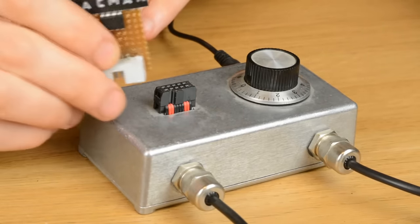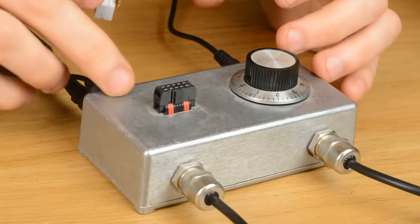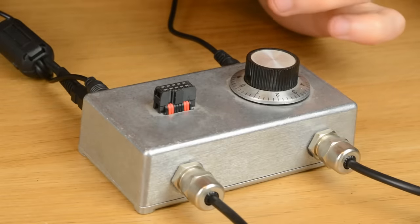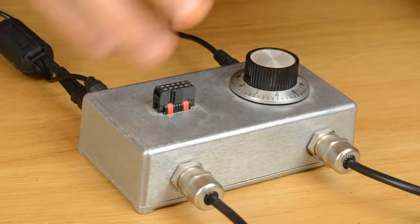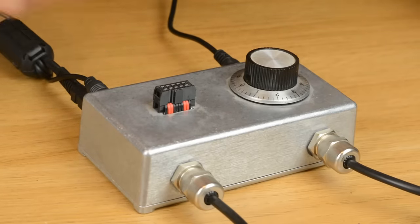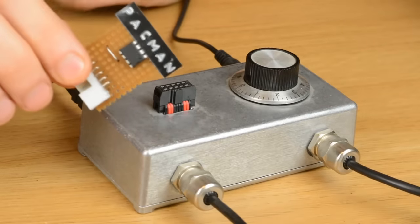But before we load this up, let's talk about what's actually happening when we load a game. The processor is 8-bit, it's an Atmega chip, and the AVR architecture is interesting. It's what we call a Harvard architecture. The program data, that's the flash memory on board the chip, has a separate address space to everything else. So the RAM, the working memory, and the peripherals all exist in a separate place to the program. And similarly, the program on this cart has its own address space.